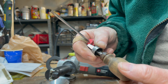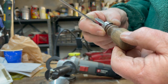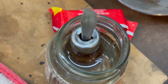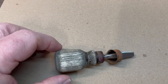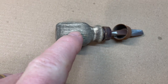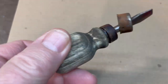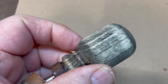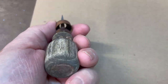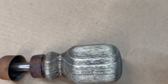At least I found out how to get that off the wood. Now I get it sanded real good, put a finish on it, and slide it back on. I've got a mixture of 50-50 water and bleach here to see how that works. I let it sit overnight with the bleach and this is how it turned out. It is lighter, but I kind of like how the black shows through with the grain. I'm going to sand it down and may put some more stain on it — maybe some ebony. But the bleach did cause that to rust a little bit, so I'll clean that up and put this thing back together. I think now I'm kind of glad it happened like this because I really like the way that looks — I may just put a finish on it and leave it like it is.